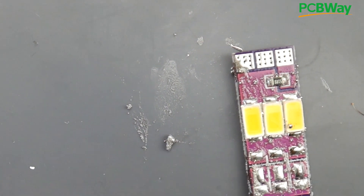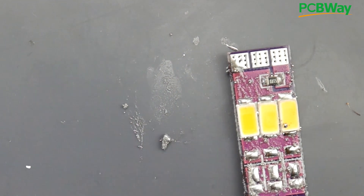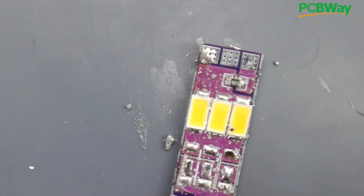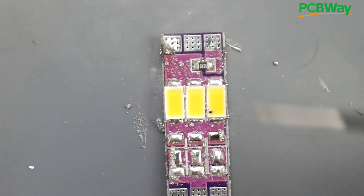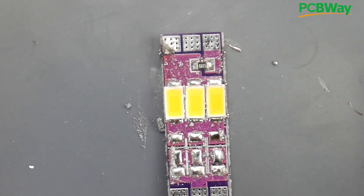Those look pretty good. I need to grab three more LEDs and do them together. If I screw up you can see how I go about fixing it. When you see little balls pop up, that just means there was a bit too much solder — keep pushing and they'll come off to the side.